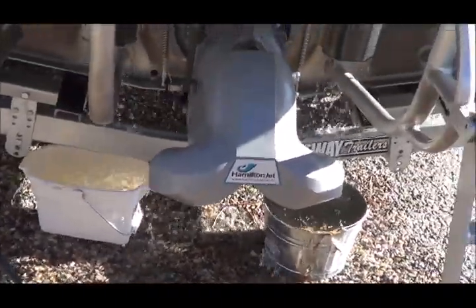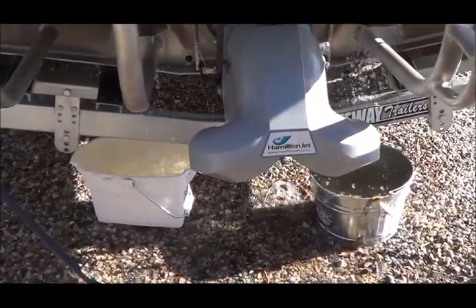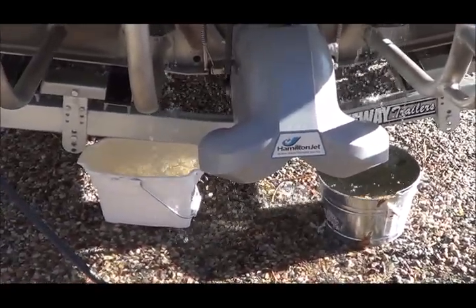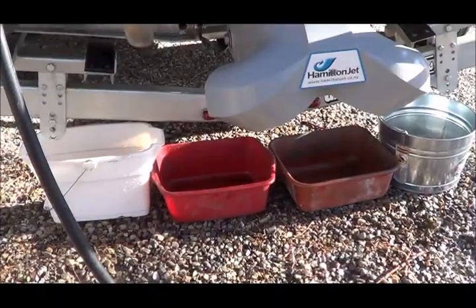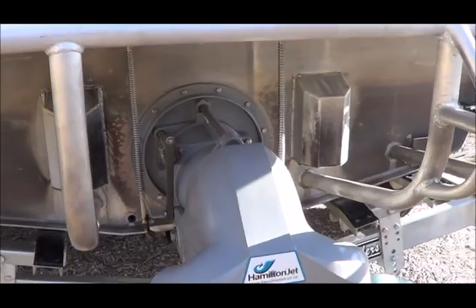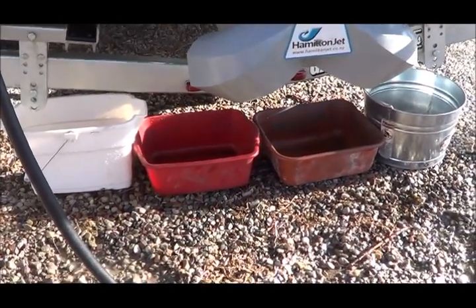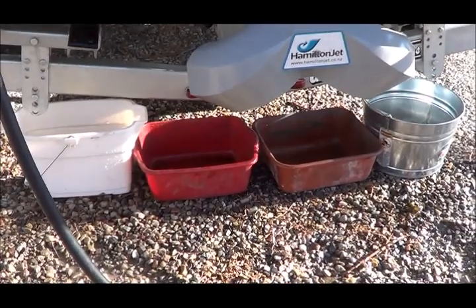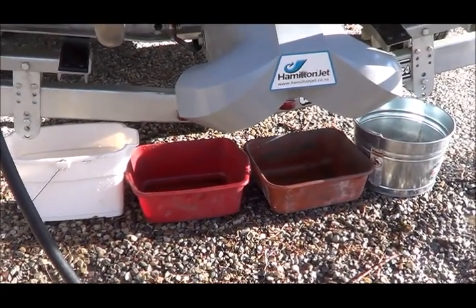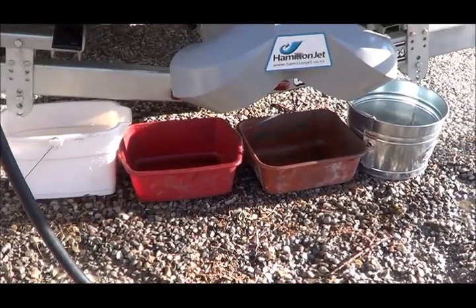Here I am with a garden hose running full blast through the cooling system. The water supply is somewhere between 30 and 60 PSI at the wellhead, but with pipe and hose distance there's some pressure drop. The idea is to catch all the water coming out of the exhaust in buckets, time it, and then we'll know the flow through the system. Unfortunately, I'm only getting about 2 PSI at the pump offtake — the engine cooling system really doesn't have much resistance in it.